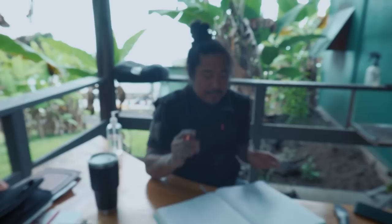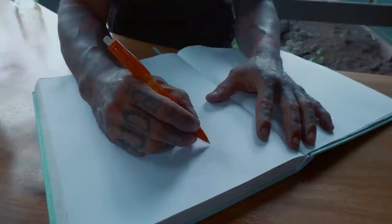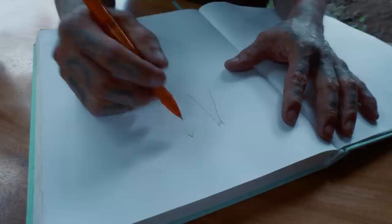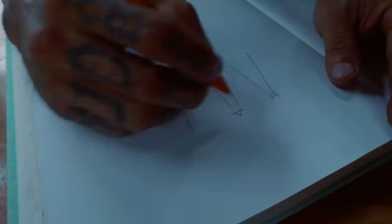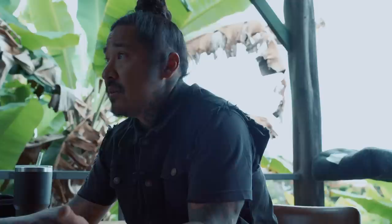What people don't understand about sharpening is what's happening up to the edge of the blade. If the edge of your blade is thick — this section in between is thick — then you end up with a blunt sharpening surface. When it's blunt like this it will shave the hairs on your arm, it will do many things, but it won't be a good edge. You could probably cut a bolt with that edge, but that's not what a knife is for.